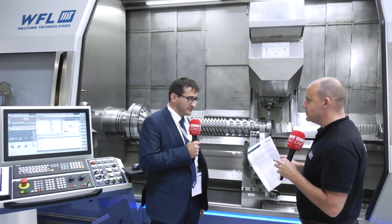It's total flexibility — you can almost machine anything complex. You've got a very powerful milling spindle, and the flexibility to use either the top milling head or the bottom as well, so you can really mix and match how you make parts. The machine can be tailored to the customer's needs — whatever the customer needs, more or less, we can equip the machine accordingly. With a single tool carrier, it enables unmanned operation during weekends for example, with no limitation on tools — especially with an integrated cell.